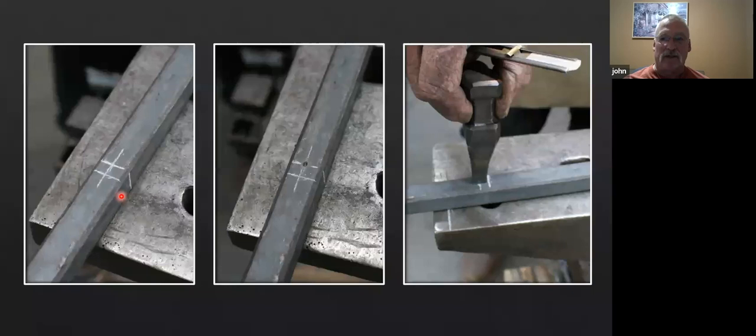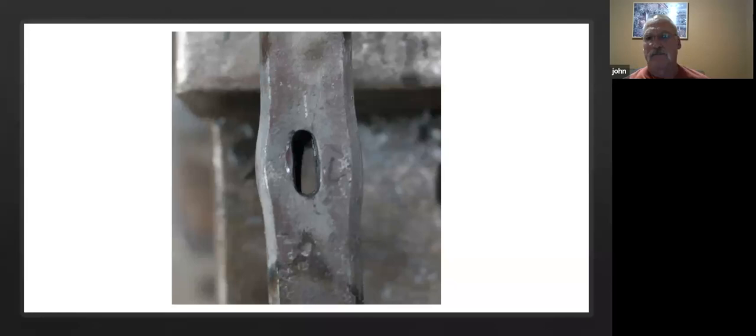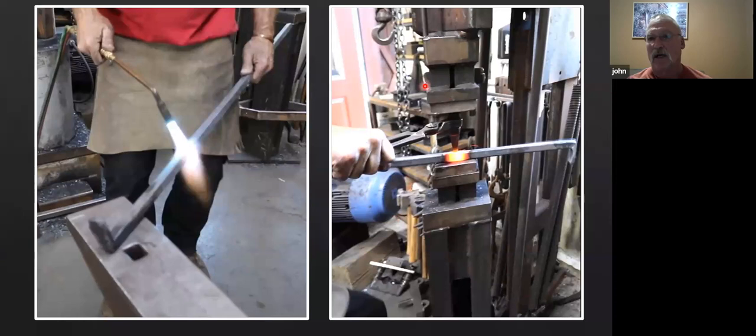Since it's a half-inch punch, I've moved over a quarter of an inch and that's where I make the center punch mark, so that when this comes out of the fire and sets on the anvil, I can line up the punch with the edge of the punch on the center of the hole where I can see it — rather than covering it up. I use local heat with a rosebud and punch the hole under the treadle hammer. There's the finished hole — it looks a little off, but by the time it's done you won't know.